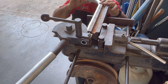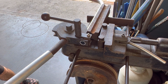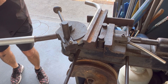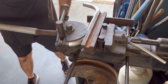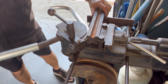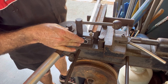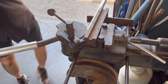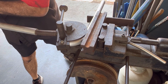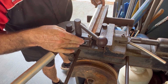The 25mm pipe is the most user-friendly. As you get bigger you need a bigger bar on it. I don't have a hydraulic pipe bender — just a hand-drawn one. I've had this for 15 years; I bought it second hand. And it's just do and repeat.